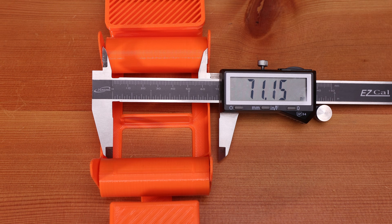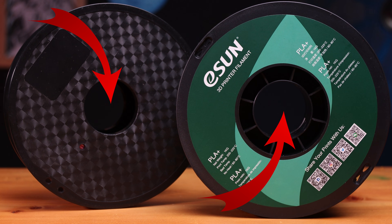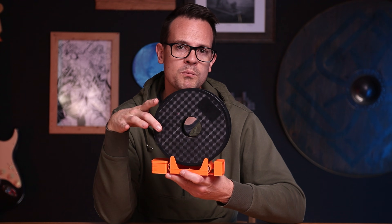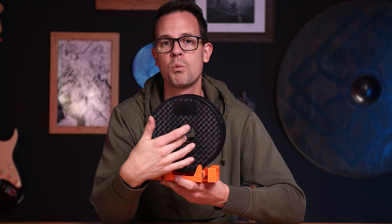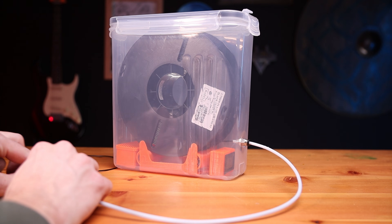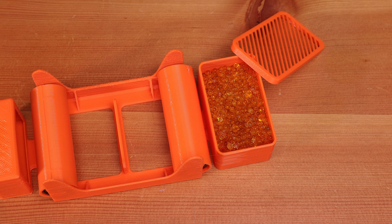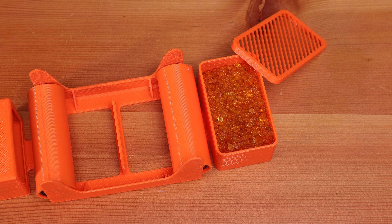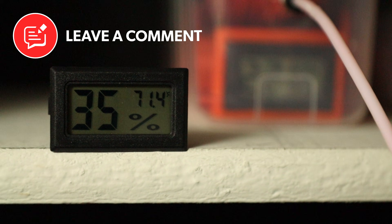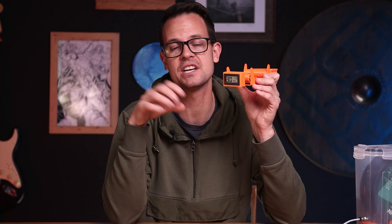When I was designing this I wanted to make sure I could accommodate rolls up to 70 millimeters wide — that's the largest I've seen so far in a one kilogram roll. Filament spools come with all sorts of different flange sizes, so I wanted a bottom roller system so it wouldn't matter what that size was. I also think the bottom rollers feed out filament a little bit more consistently than holding on some sort of a rod. Since we're already in an airtight container, I put a desiccant container on the back of the roller and, just for fun because I like numbers, a humidity and temperature sensor, so you can make sure the humidity of your filament is staying in the range you're interested in.